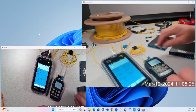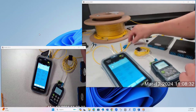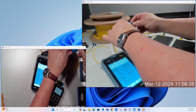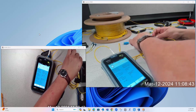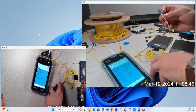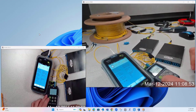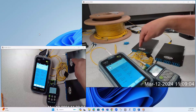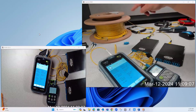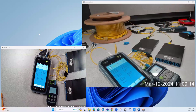Now if you're two technicians, one of them is going to walk to the opposite side. We'll separate the two fibers here in the middle. I'm going to connect to fiber number one on this side — remembering our polarity check from earlier — and connect to fiber number one on the other side. I quickly have a loss value: 1.3 dB from end to end. That would be from cassette one, through the spool of fiber wherever it's running in your facility, to cassette two, all the way through cassette two.